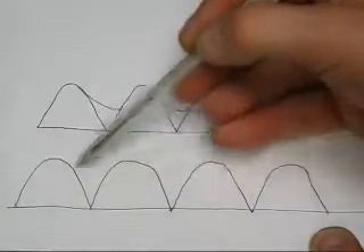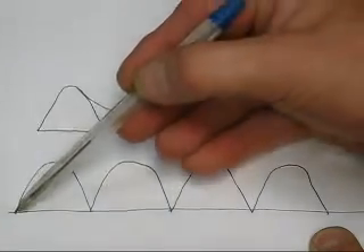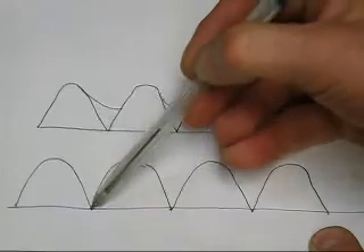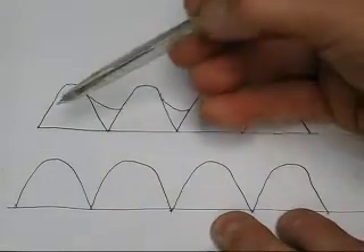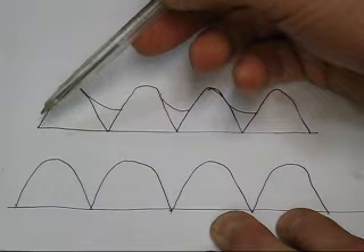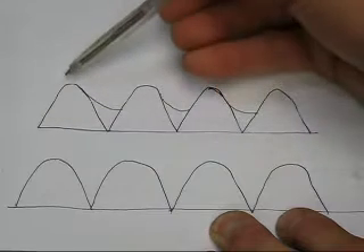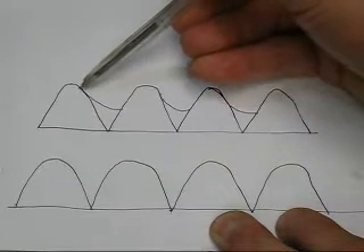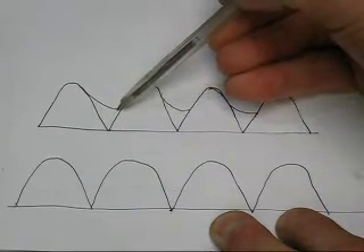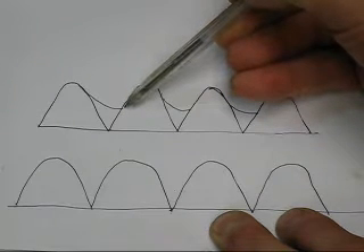This is a waveform from a full bridge rectifier — it's no different. It starts at zero, goes to full voltage, then goes to zero. Now how I would intend to change that is to use an inductor or a choke and use capacitors, so it'll start at zero and then go to maximum voltage, but the waveform will not go back to zero again, therefore making the arc easier to strike and also to run.